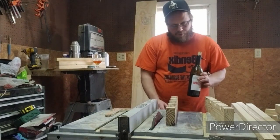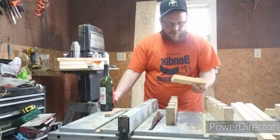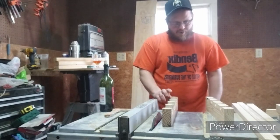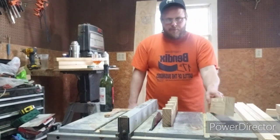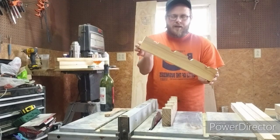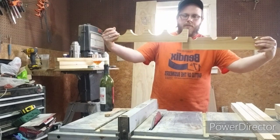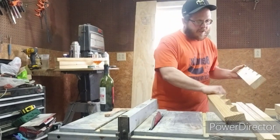And I thought and thought and thought about it with making stretchers that would cut at a 15 degree angle that would lift one end up. The more I thought about it, yes, this might look better, but what I'm going to do is just cut these, the end that receives the bottleneck, and just cut them down to about half the size of this end, so it'll sit lower, about like that, and the bottle will still be tilted at an angle. So I'm going to start making those cuts now.